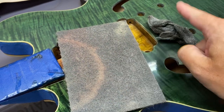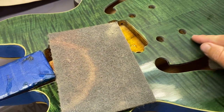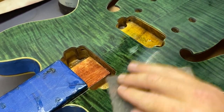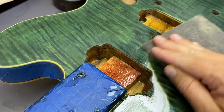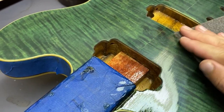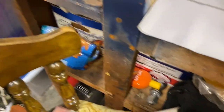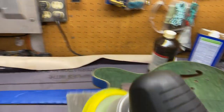The reason I like to use the gray Scotch-Brite pad over the steel wool for the final cut down is that steel wool can actually leave some deeper little scratches in your finish, whereas the gray Scotch-Brite will not. So this is just being used to knock down the top layer of the true oil and help remove any of the dirt nubs, so whenever I go into the wet sanding process, everything comes out really nice and smooth. I'm not putting any pressure — just lightly going back and forth in the direction of how I put on all the clear. Then I'll go across it and use one attached to my buffer at a slow speed to level anything out, and then I'll start to hand sand.